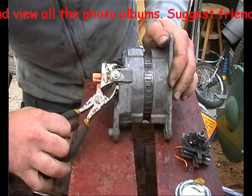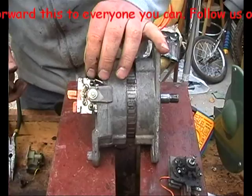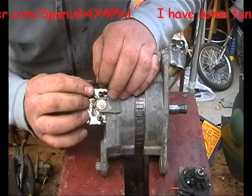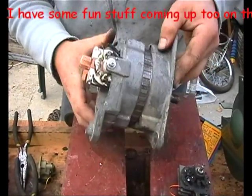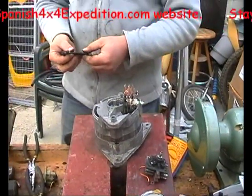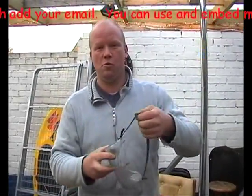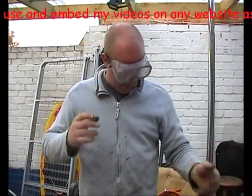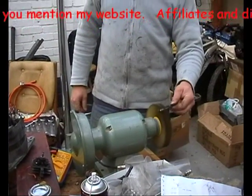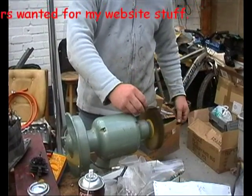So we may have to reposition them entirely, but we're going to tidy them up when they're a bit cooler. Snip the excess bits off like that. Once again, make sure none of it goes into your windings. Yeah, it's cool already — that one nice and flat. We'll give the bolts a quick whizz up on the wheel — put some goggles on. There we go. Clean the thread out as well.